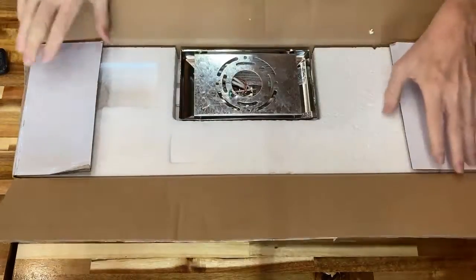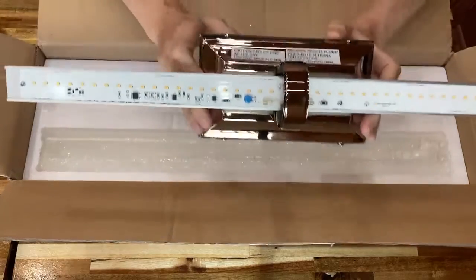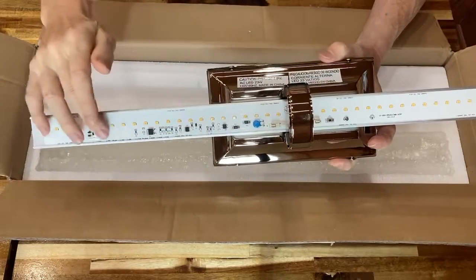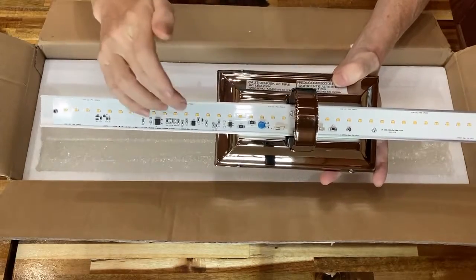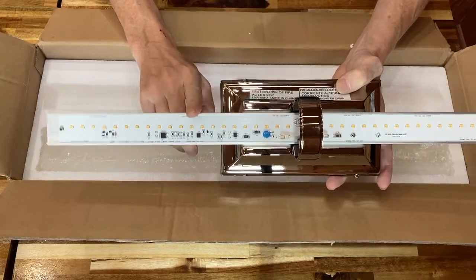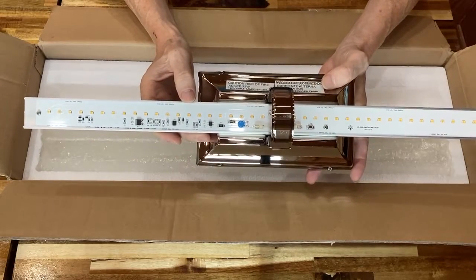Here is our fixture, nicely packed. What you see here is the 120-volt light panel, and this is where the 120-volt input is converted by these LEDs into light. This is inherently a non-dimmable fixture and it is a fixed color temperature — this one in particular is a cool white, around 4,000 degrees Kelvin.